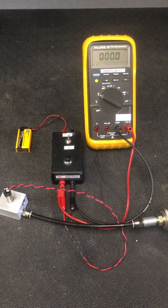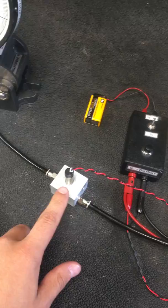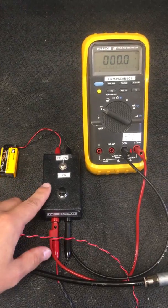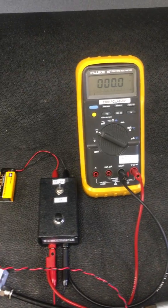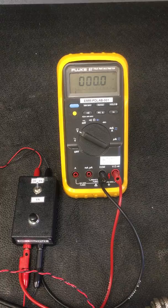All right, we've got our latching demo here. We've got our inlet pressure coming in at 80 psi, all the way down into our latching valve. We've got it hooked up to a gauge on the other end. We've got our switch box so we can switch between energizing and de-energizing the valve, hooked up to our battery. And we've got a voltage meter so you can see that instantaneous voltage connection.